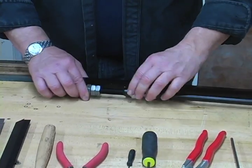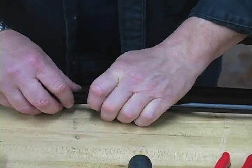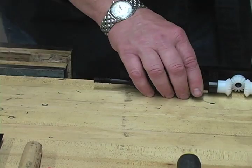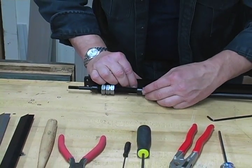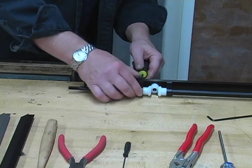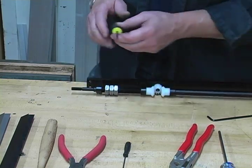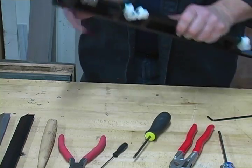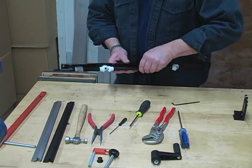This goes on — we're just going to get it started. This whole assembly will slide back and forth, and what I want to do is align my two gears, hold that flush, and tighten that front bearing block. Now this back bearing block will slide — I want to push it all the way up so that it touches, hold it flush, and lock it. At this point I should be able to roll the entire assembly with finger pressure. It still might feel stiff — that's okay, we're going to loosen it up when we burn the bearings in.